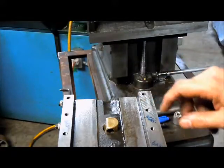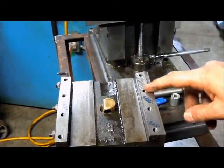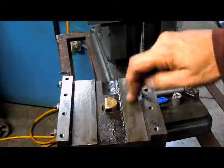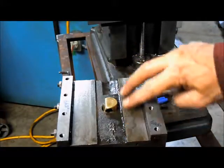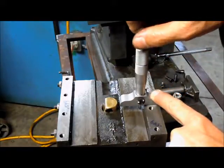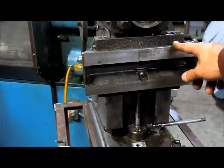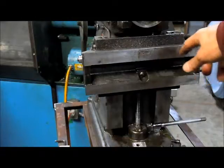I took a slightly different approach — rather than just guessing at it, I've got the table off again. What I'm doing is measuring between where the keeper goes. This is just a milled surface; over usage it's fairly smooth — definitely not scraped or ground. I'm measuring this depth with the depth mic, both sides, and then I'll mic the thickness of what I'm calling the crossrail — I'm not sure what the actual name of it is.